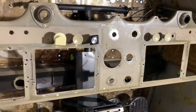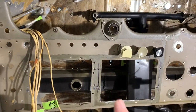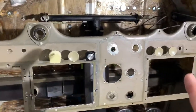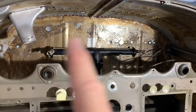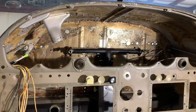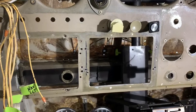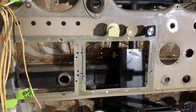The plan is to start to reassemble the panel. This particular customer wants to make this a breaker panel, put his radios here, we'll put the intercom here, and this will remain a glove box. We do have a new floating panel coming from Aerotronics — a very nice panel — and we're putting a couple of G5s in the panel as well as a JPI 930. Down here, we'll put a Garmin transponder GPS as well as a Garmin COM.